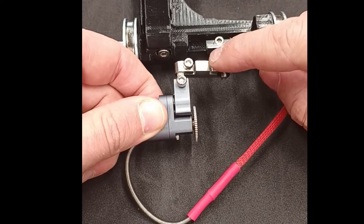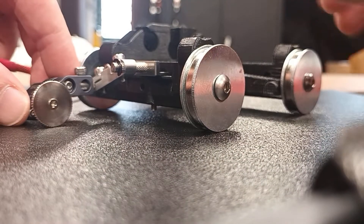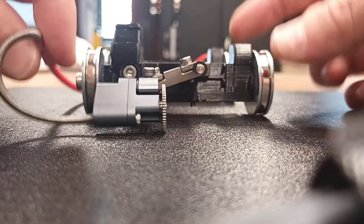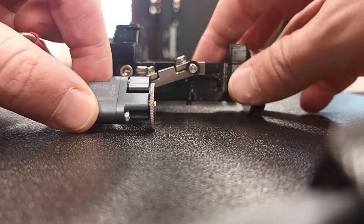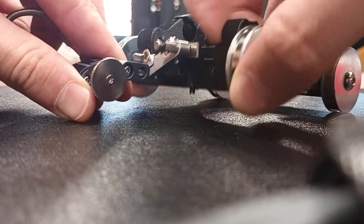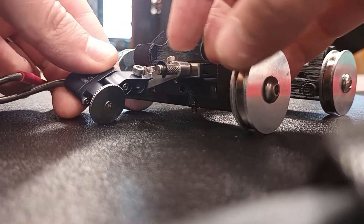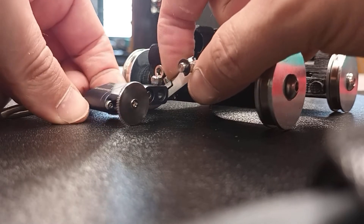Keep this loose and keep this loose so we can put that down. The attachments here are all loose, everything is free, and you can see how this cable can drag — so we want to keep the encoder off the ground and make sure it's engaged. We also want to make sure the spring is engaged: when the magnetic wheels are down, this spring should be under tension. When we tighten up all the screws, we want to make sure this arm is leaned a bit further down so it engages the spring.